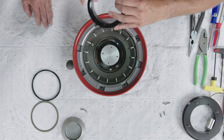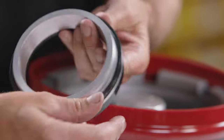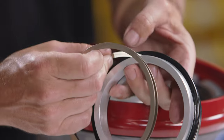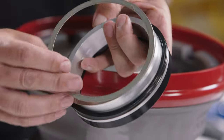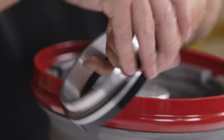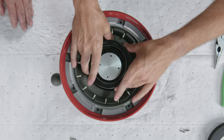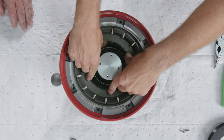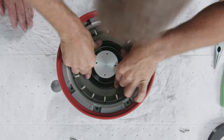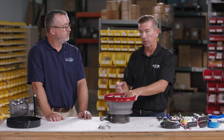Reassemble the nose seal by sliding the quad ring onto it until it's set against the lip, then reinstall the backup ring by taking one tab, sliding it into the retaining ring groove, and walking it around the nose seal. Confirm the quad ring and retaining ring are properly seated. Firmly push the nose seal into the body with even force on both sides — operating the handle to close will also help seat the nose seal into position.